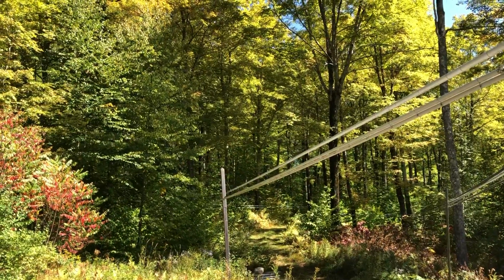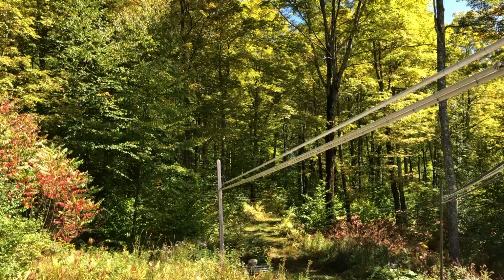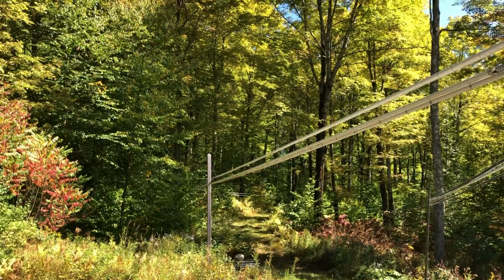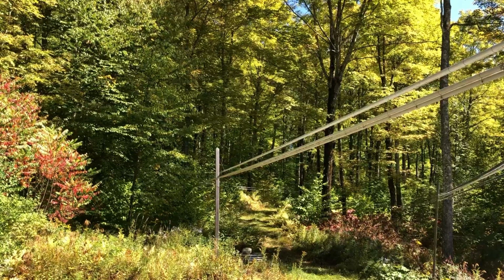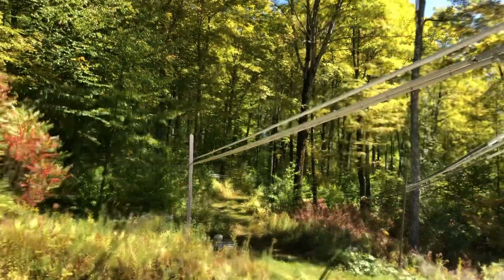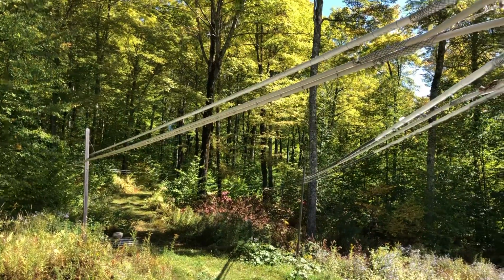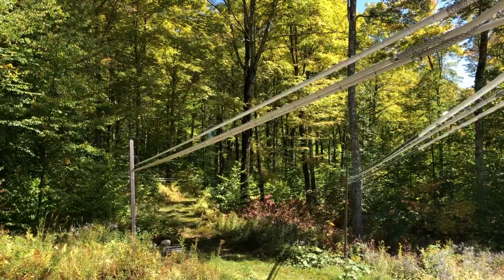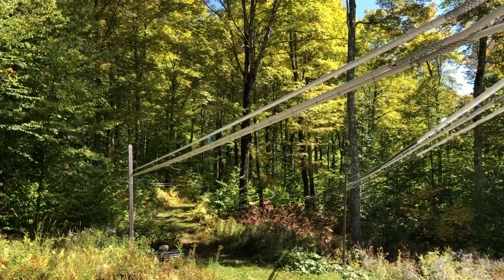I've really only seen the vacuum drop 1 inch when it's running hard. But 1 inch of loss is 1 inch of loss. When you're running 27.5, 28 inches of vacuum and you're losing 1 inch or so on a good flow day, you are losing sap. And the other two lines you see there, two 1 inch lines, those just run out there to get some sap. One's 1,000 feet long, the other one's like 700 feet.